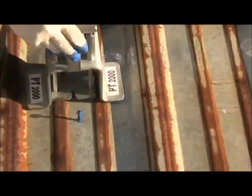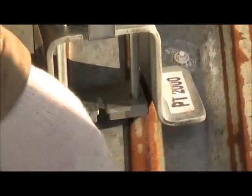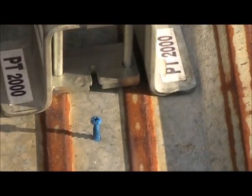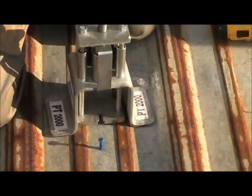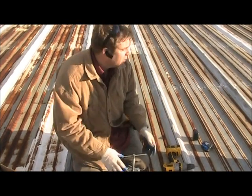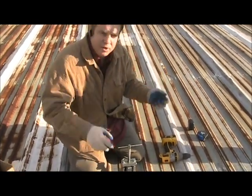What we want to do is get this slot right here over this screw so that we can apply pressure and determine how much pull-out value we have, so that we know when we fasten insulation membrane over this that we have adequate wind uplift resistance with these screws.